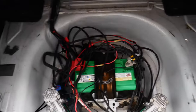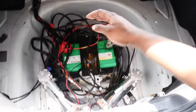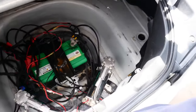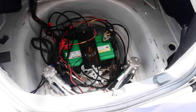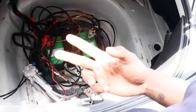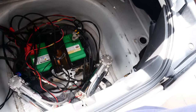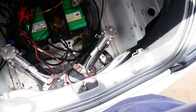Got everything out and set off to the side. Now what we're gonna do is I'm gonna try to clean up these wires and also spray down all of the fittings with some soapy water and see if I can find the leak. That way we can stop it because the compressor had to kick on twice this morning — the tank wasn't full when I first turned it on, and then I was driving and it cut back on to fill up the tank again. So there's definitely a leak and we're gonna try to find it.